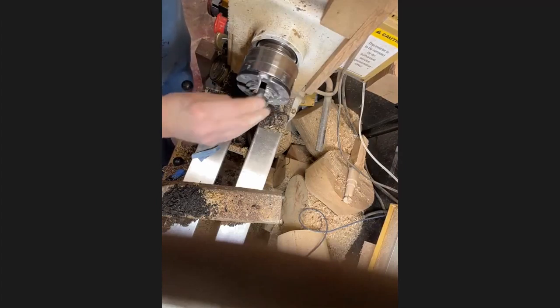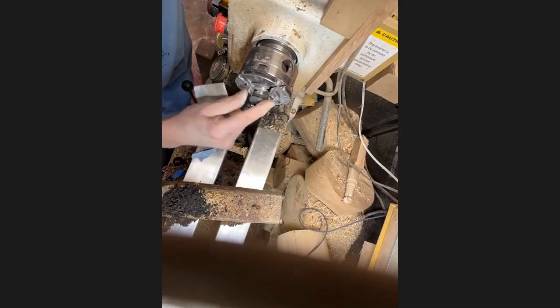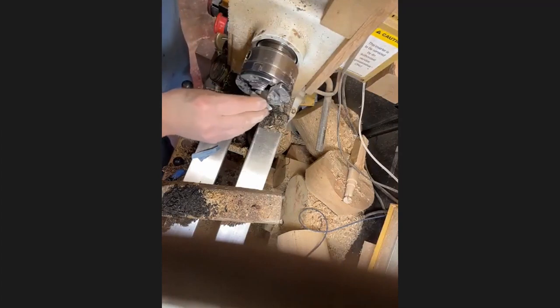You can never sand just to finish with the lathe spinning, because as soon as you put finish on it, the finish is going to magnify all your scratches. And it's just like on a CD, right? If all the grooves are going in one direction, if all your sanding scratches are going in one direction, then any streak, any piece of light in the wood or in the room will make a streak of light across your thing. So as long as you go to 800 random orbit, you won't have any streaks of light across your wood. Okay, we are done.